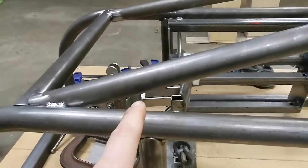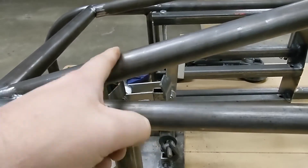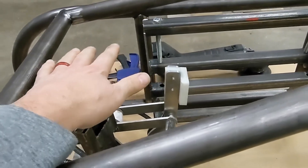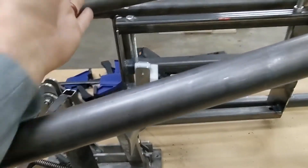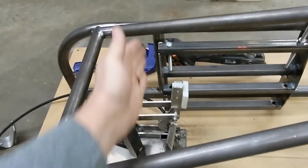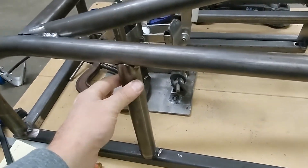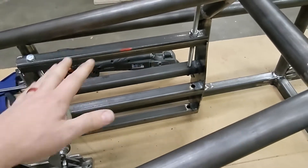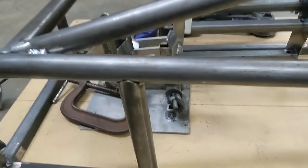I'm getting ready to cut right now. There's a tube that's going to go right here, kind of in line to help take the load, because there's a steering rack that's going to mount over the top right here. The steering rack needs to mount to some stuff and there's going to be some load on that rack, so I want to make sure that load gets spread throughout the chassis. There's a tube going across these diagonal tubes up top, and I want that load tied directly into this frame rail and into the triangulation bar that goes down there. On this side it's loose — that's where all the front suspension mounts.